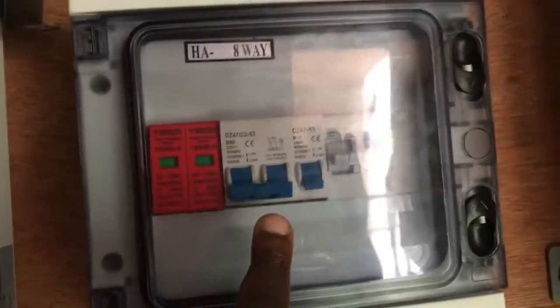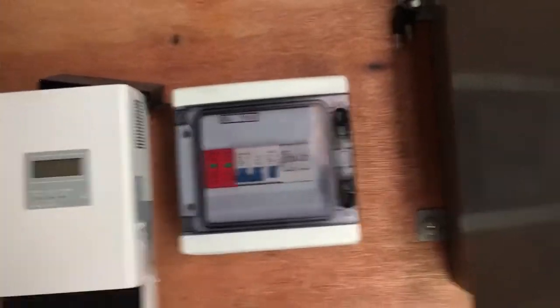This is our AC box, which I'm going to be talking about later. It has the Class 2 SPD in it, an input breaker, control breaker, switchover — all pre-wired. We are just hooking up the inverters now and then we will be off to join the other team.